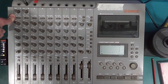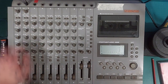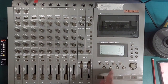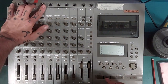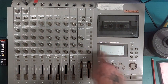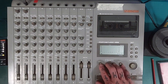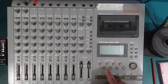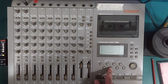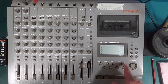So what have we demonstrated so far? How we can use the direct-to-group switches for channels one through four, meaning we don't go through the mixer channel at all — it goes straight to the master fader. We then use the record function buttons to assign them to tracks, so we can use those four inputs to bypass the mixer completely and record directly with a little bit of pre-amplification to the cassette player. Using those buttons gives us access to any of the eight tracks, recording up to four at a time — any combination of tracks, with the mutually exclusive pairs of one or five, two or six, three or seven, four or eight.